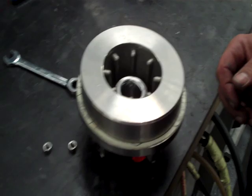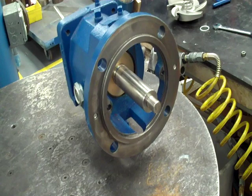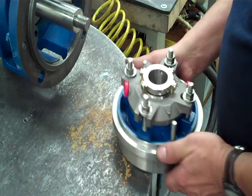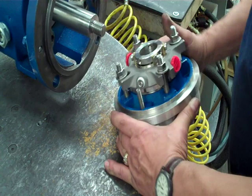When we take our sleeve, put it around the shaft of our power frame. Take our stuffing box and seal, flush line facing towards the sight glass, straight on.